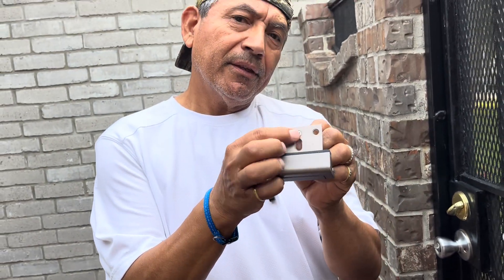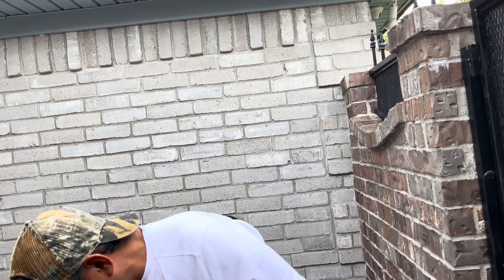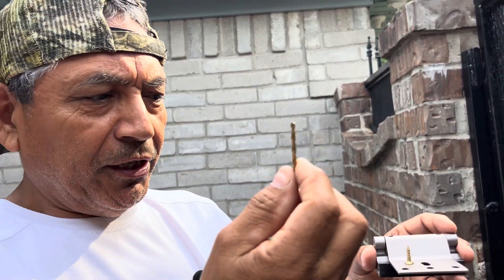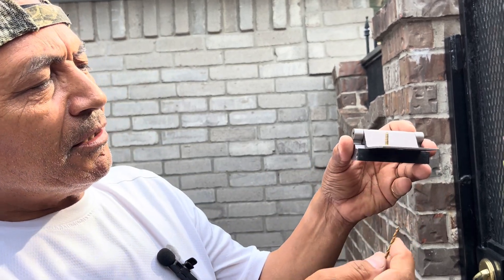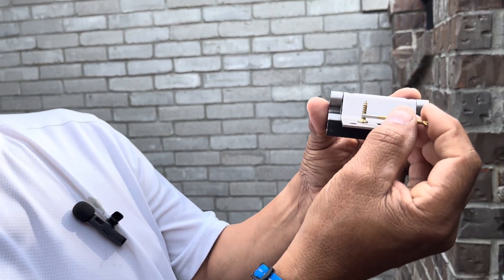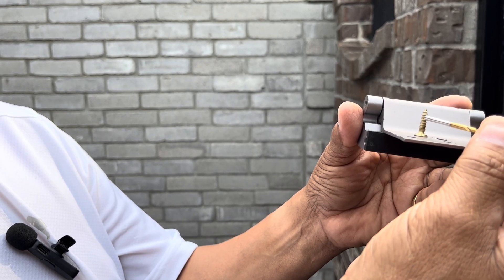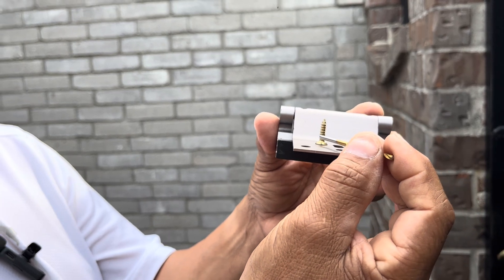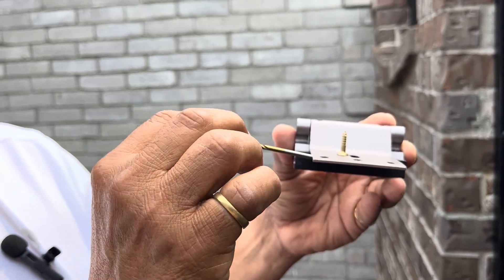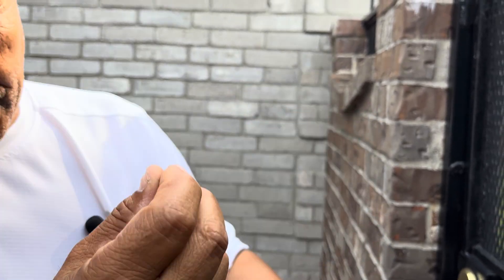Make sure the screw is like this. See this screw? You make the hole first — but this bit is too thick for this screw, you need a slightly thinner one. This screw has two threads: an ordinary coarse thread on the top and a fine thread on the bottom. That means when the screw goes into the metal, the coarse thread makes a path for the fine thread, and the fine thread is what secures and tightens the piece protecting your door. It's a tight two-in-one thread, and this type is also designed for metal.